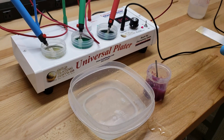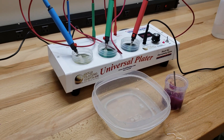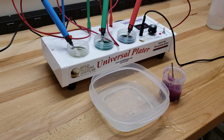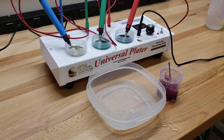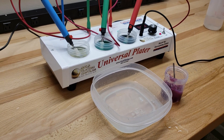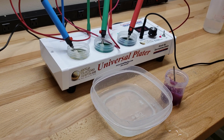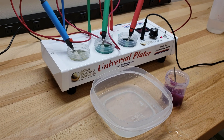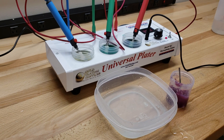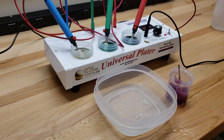That's how you nickel plate and gold plate onto steel, stainless steel, any kind of steel — same process. Electro clean it until it completely wets out — do that at 7 volts. Strike at 7 volts as well, spending about 10 to 15 seconds on an area that size. Rinse that off really well. Do the nickel plating at 4 volts and you should get a nice layer of nickel on there. Then you can go ahead and gold plate it, or just leave it nickel if that's what you desire. Thanks for watching.